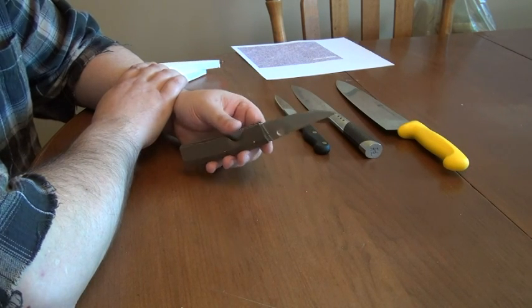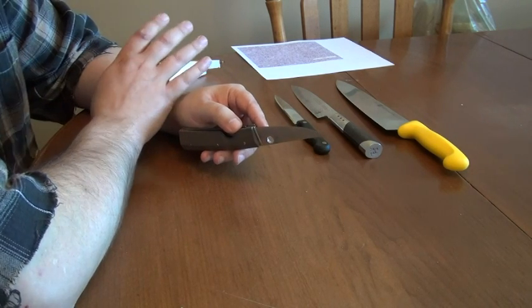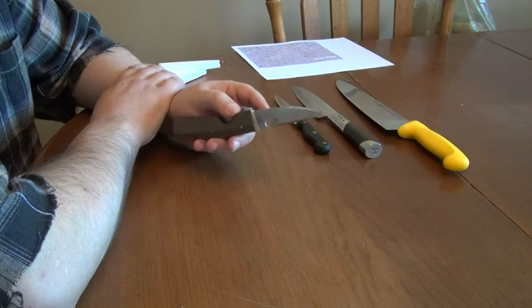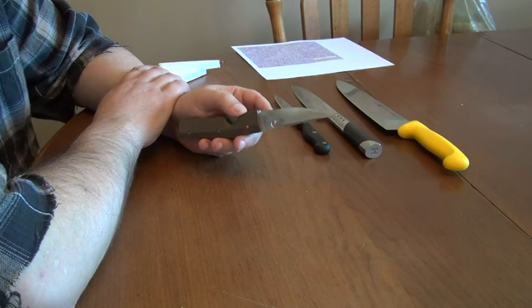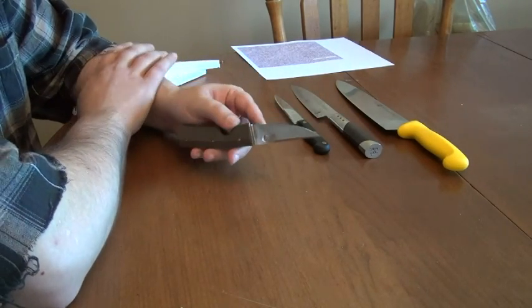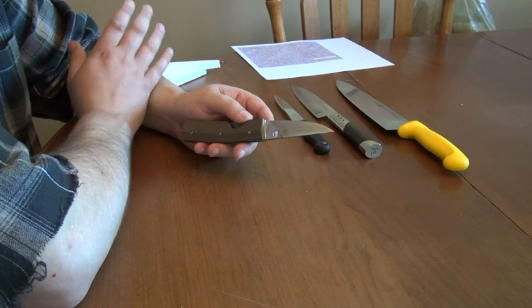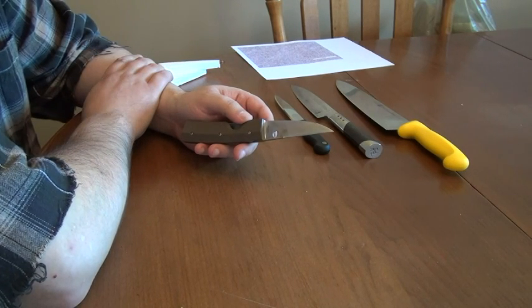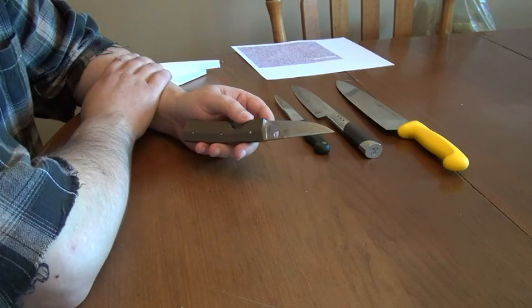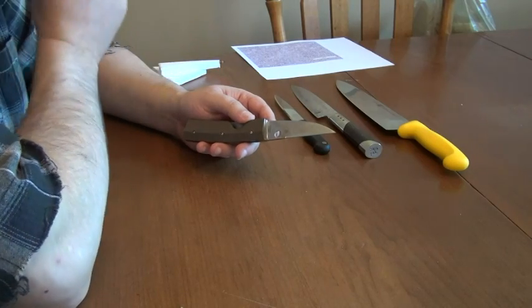Initially when I used this, it showed damage relatively easily on light work — cardboard, light plastics. I suspect that wasn't due to the extreme edge profile, which is around five degrees per side because it's a continuous grind. There's no actual secondary or transition bevel, but because the edge was actually overheated in use and most likely water or rapid quench to cool it down, which probably micro-cracked it. To test that hypothesis, I just sharpened it a bunch of times and kept repeating the work, and as I sharpened it and repeated the work, the edge got more durable.